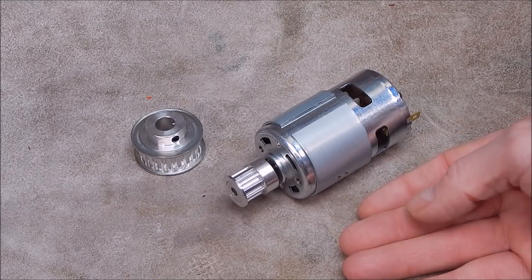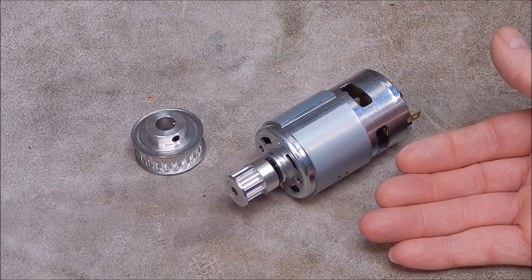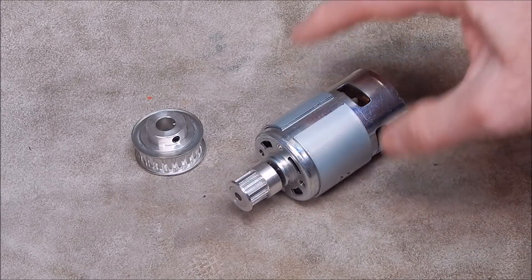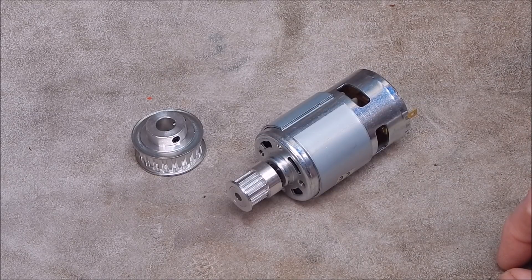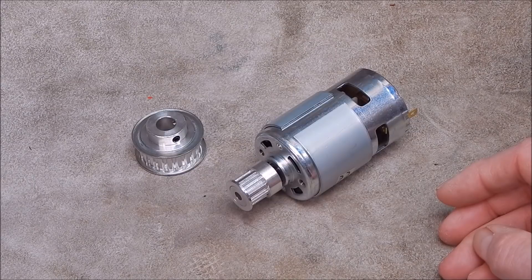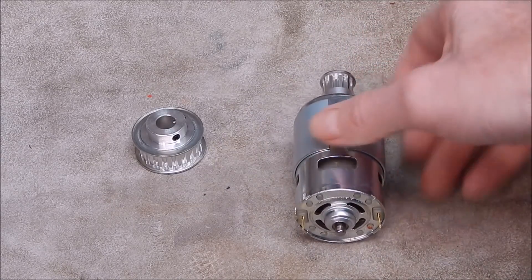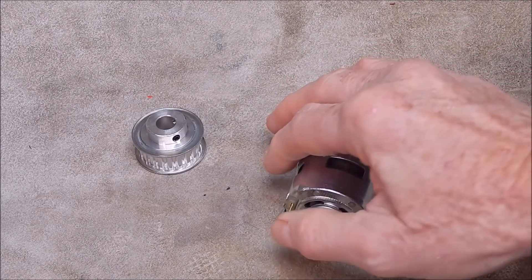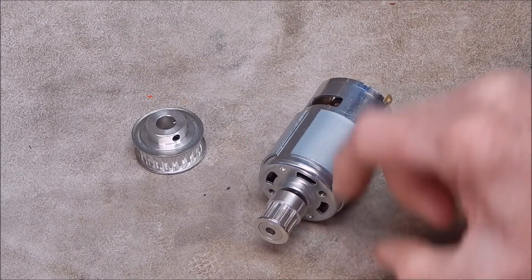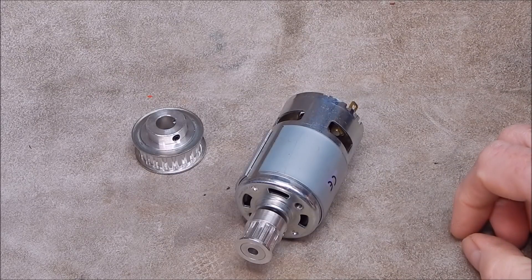For grinding you want to spin the motor at a higher speed, which means you need a higher-voltage DC power supply. I did run this off my commercial DC power supply and took it up to 50 volts — no problem, no smoke. I wouldn't want to run it at 50 volts for too long, but it handled it, nothing got hot, and it seems to be quite a rugged little motor. It has ball bearings, mounting tabs on the back, and takes 4mm screws into the front, or you can clamp it as you would on a CNC router or engraver setup.